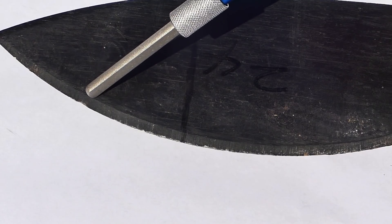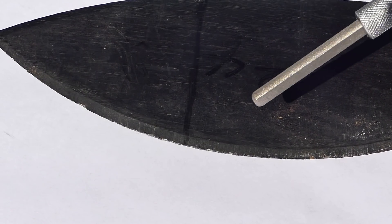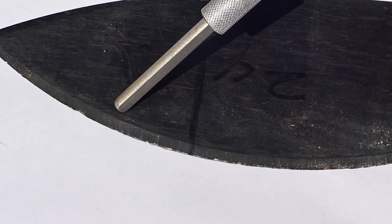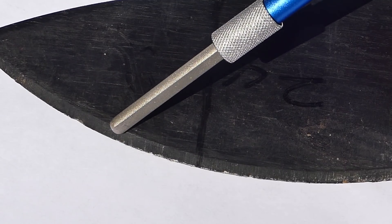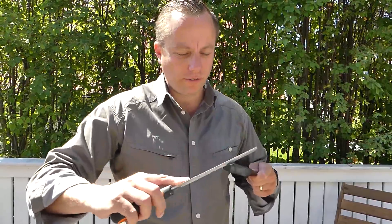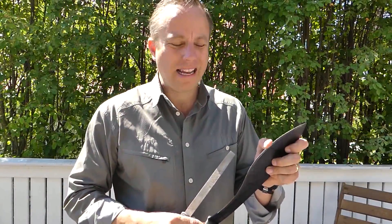It's an interesting little project — we'll see what happens. The worst of the damage is up on the belly: we've got chipping and rolling, general snagging, some small chips and a bigger chip in here. This is suspicious — when you see a blade that rolls like this and it hasn't been smashed into concrete, and I'm told it's just been used for chopping in the bush, I'm a little suspicious that maybe it hasn't got the best heat treat, not so much from the chipping but the rolling. Filing it now — it's very, very soft, which makes me even more suspicious about the heat treat.